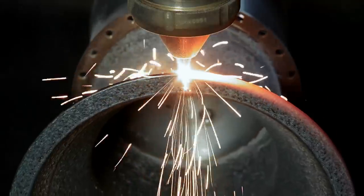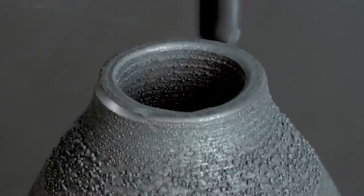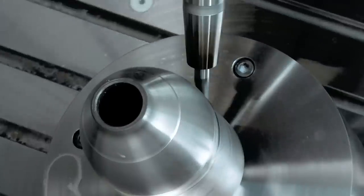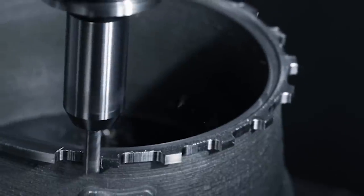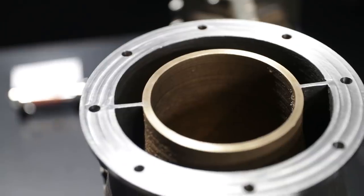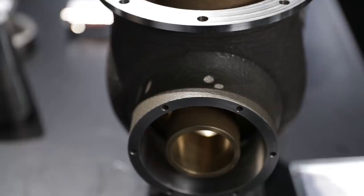Sure. It's a combination of 3D printing — additive — plus subtractive CNC. We print layer by layer, additively build up parts, and do the final milling within the same clamping situation, and it's ready for installation. It's not only additive; it makes use of multi-material application. The part we built here is a dual channel connector — stainless steel and aluminum copper in combination. You build it up, do all the milling, and it's done.